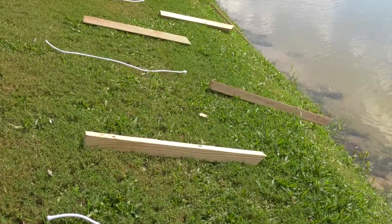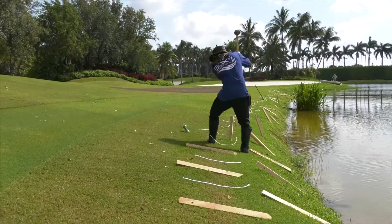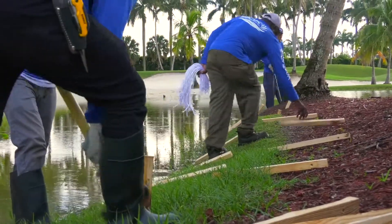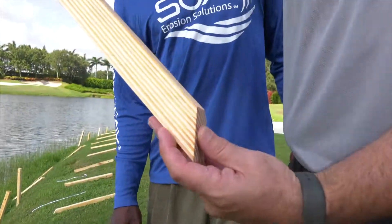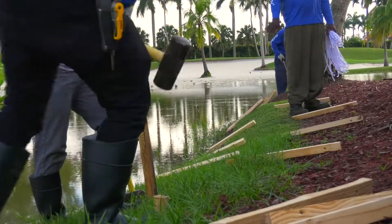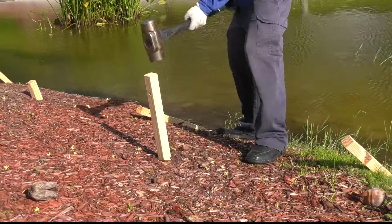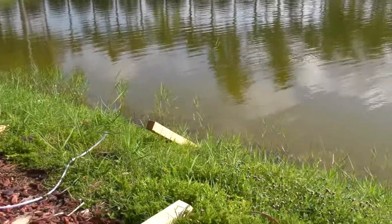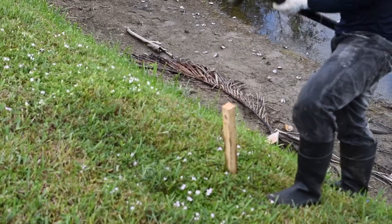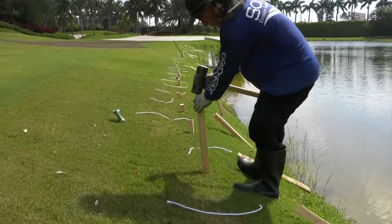You will then lay out the stakes on the top tier. The top row is staggered adjacent from the bottom row. Once the stakes are laid out, you can begin by staking in the bottom row straight into the ground with the beveled edge facing the water. That beveled edge will act like a fulcrum when pressure is put on it. After the bottom row is secured, you will then stake the top row according to what the eroded area allows, also with the beveled edge facing the water, but these stakes will be staked at a 45-degree angle with the pre-drilled hole facing the water. This top row will not be secured completely underground until the finalization step.